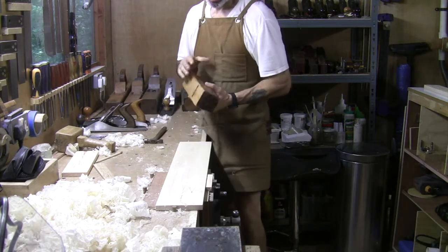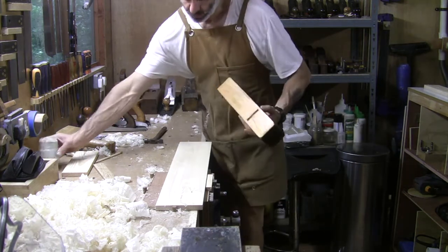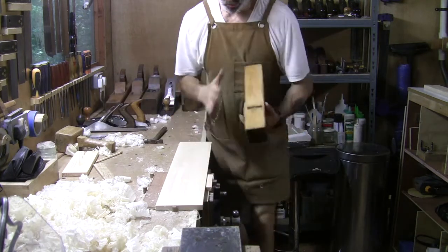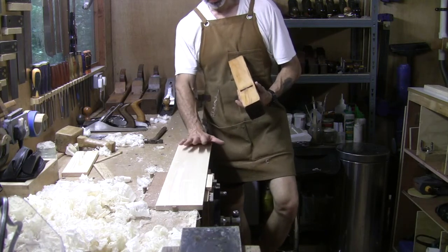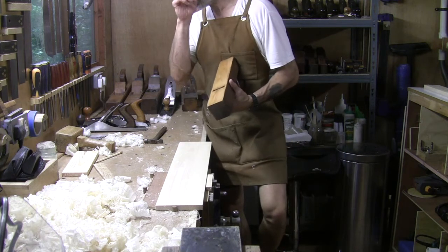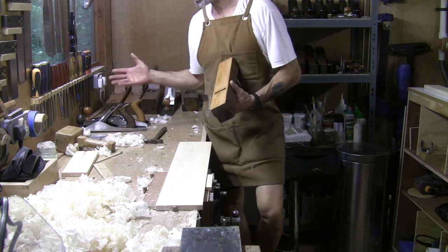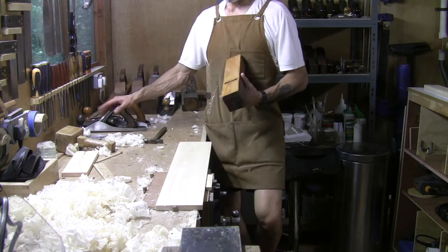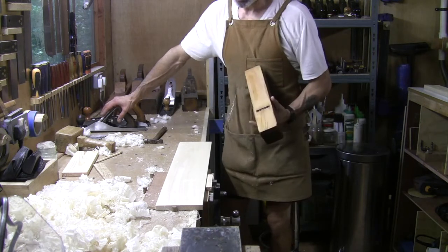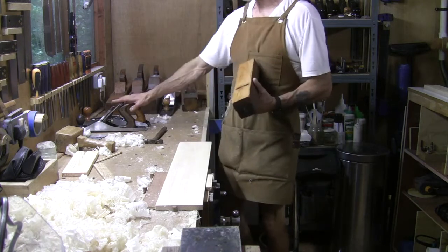I really, really like the last finish to actually be one of the wooden planes. For some reason it's just really, really lovely to the touch. And I believe that the wood would burnish, the burnish from a wooden plane is different. So when I have to remove quite a bit of material, or it's really hard to get it nice and flat, I tend to use my number fives. I have a 5.5, which I haven't restored yet. It's in a bit of a state, so that'll take me a while. So after the jointer, I go either to number 6 or number 5.